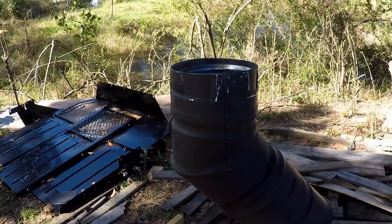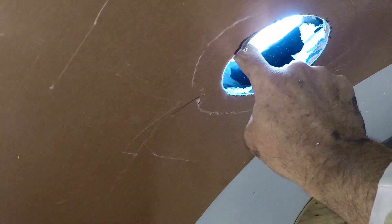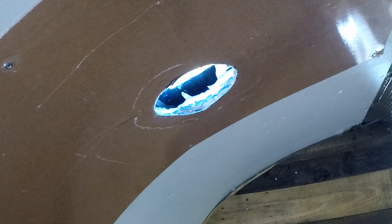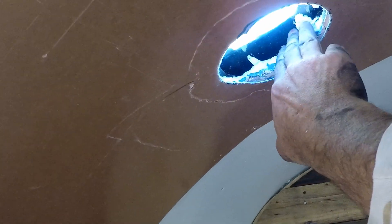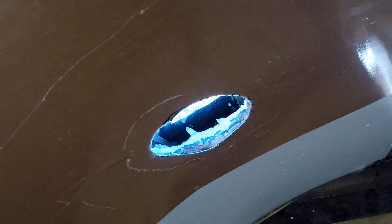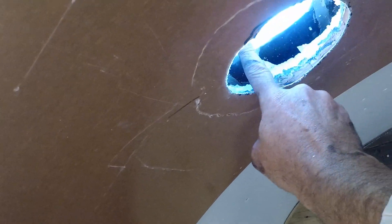It says three inches, but it's actually about three and a quarter inches — that's important to know, you just can't cut a three-inch hole. The trick is you want to cut a five-inch diameter hole. You just center it, and I already centered it yesterday, so I knew where to cut. The reason you want five inches is because the heat really builds up. So I push this insulation away a little bit more before I put the vent pipe in there — that's our foam insulation and I'm going to make sure that's out of the way.